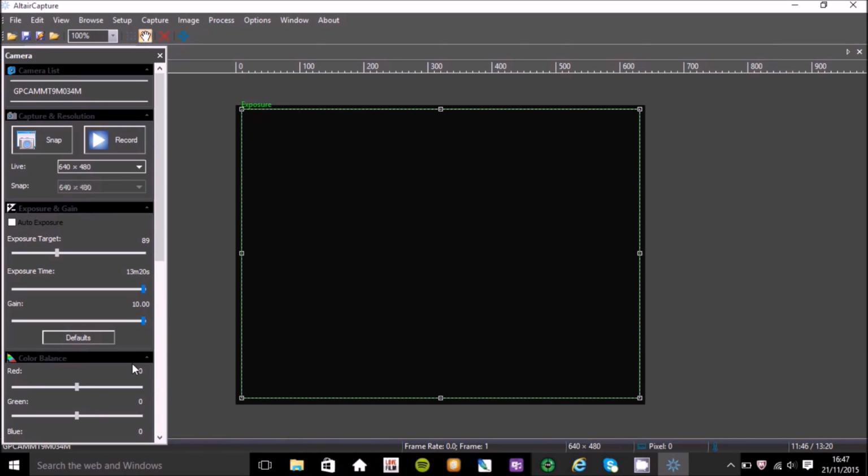As you can see here at the bottom, at 11:39 seconds, this is the exposure it's doing. So basically what we're doing is waiting until it takes that initial capture shot, and then we'll come back after the timer is set down to show you how bad the noise is. Now the fan is not connected to the camera, so it's switched off. So we're testing the actual electronics of the camera without the fan operating.